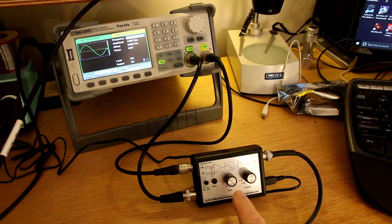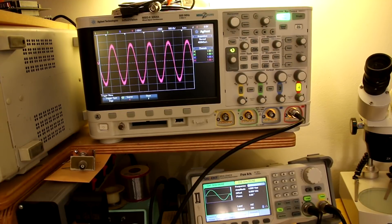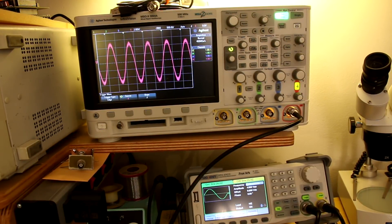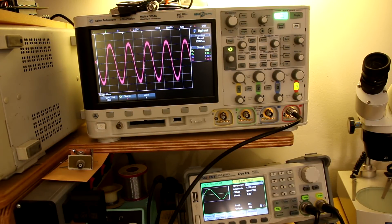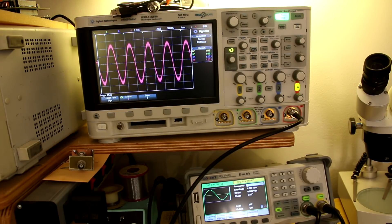I've got the system here set to a gain of 1,000. And here on the scope, you can see that the signal is basically enormous — that's 2 volts per division. There's a tremendous amount of gain. That is the 10 millivolt difference in voltage between the two sine waves. This is a classic case where there's a tremendous amount of common mode voltage between the two signals; they both are riding basically on top of 4 volts, and we're looking for something very small that's the difference between them.